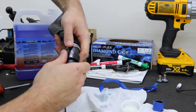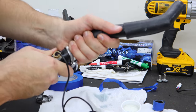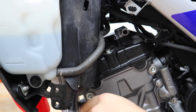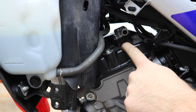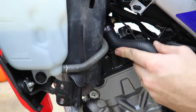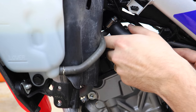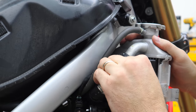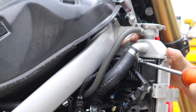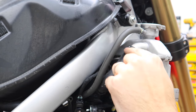To reinstall the hose onto the sensor fitting, work it left-right, forward-back until it's touching on both sides, get the letters lined up, give it a slight twist, and tighten up the clamps. Take the other hose, pop it off and set it aside momentarily, then re-snake it once the sensor hose is in place. Fish the power cable from this side over, tuck that out of the way for a moment, get the hose clamp back on, and push it back onto the fitting. You can use a small screwdriver to tighten the clamps — don't overtorque or you can cut the hose.